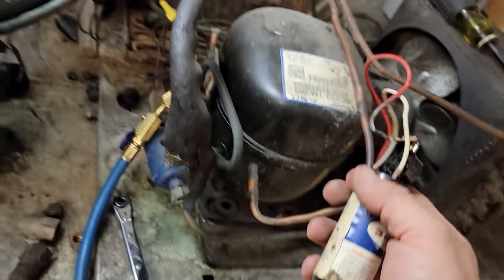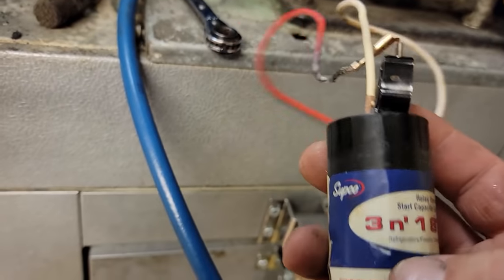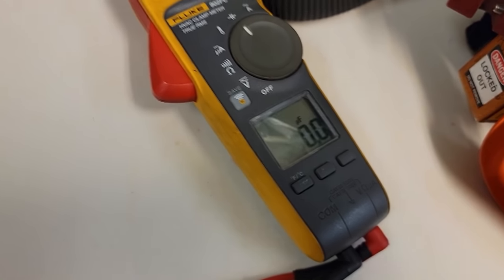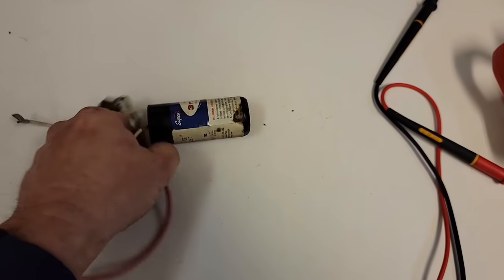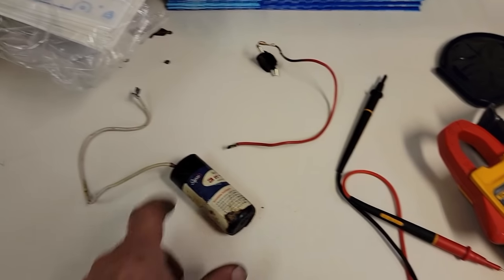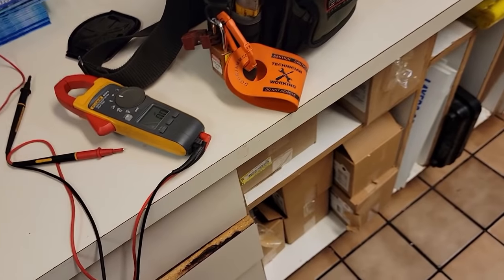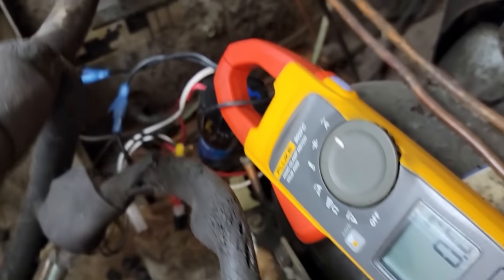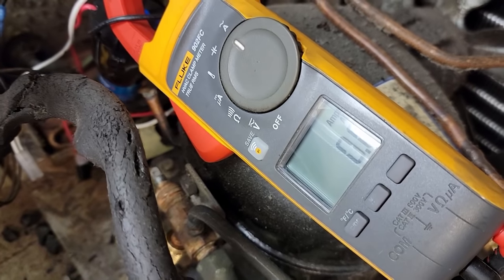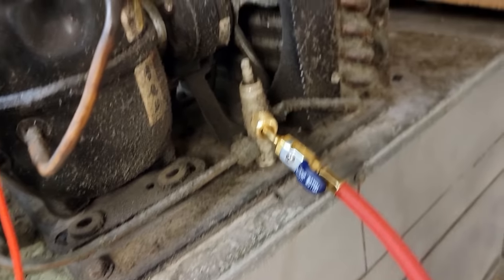Supposedly they've bought property for a new store so everything's going to be jerry-rigged for now. We are at 256 microfarad. I don't think it's going to run but we can try. I got the one I just removed - a 3-in-1 - got this thing queued up ready to go. Let's see if this thing will run. Maybe we can try out my Viper cleaner on this nasty looking coil and see if we can make this thing run.